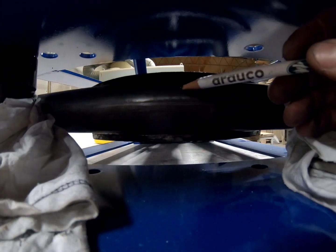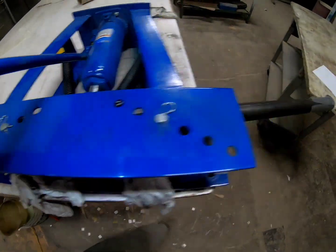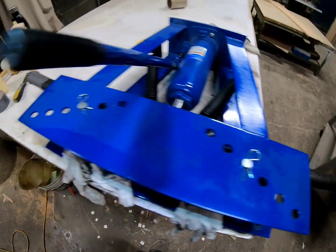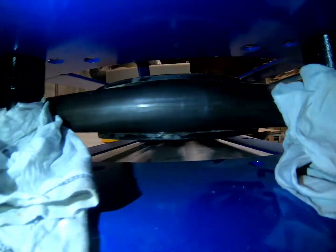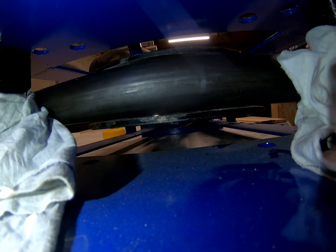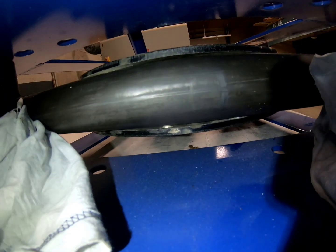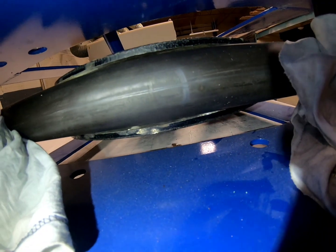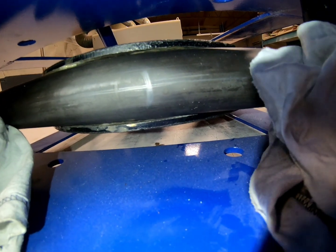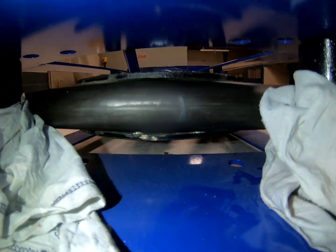I'm going to mark where the center was. As you can see, the pipe is bent — it definitely has a bend in it. That was 14 full pumps. Now I'm going to release it and move it closer to my original line. I'll probably do one position before the actual line, then hit the line, then do two more after that. From my experience that should put me at about a 45-degree angle.